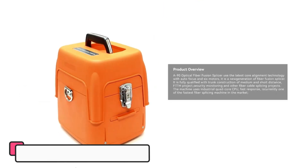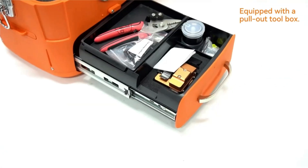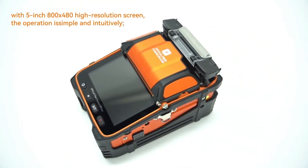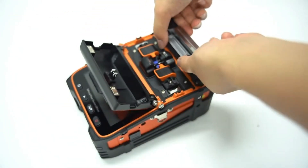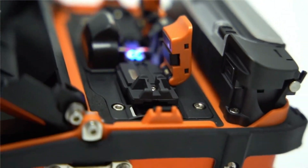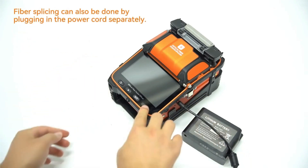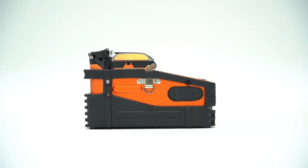Number 1: FCST Communication AI-9. The FCST Communication AI-9 Optical Fiber Fusion Splicer is a versatile tool for fiber optic installation and maintenance professionals. It supports multiple fiber types, offers fast performance with a splicing time of just 5 seconds and a heating time of 15 seconds, and features a 5-inch TFT color display for easy monitoring. The machine has a six-motor autofocus system for accurate splicing, low splice loss, real-time arc calibration, and exceptional return loss. It offers fully automatic splicing options for both novice and experienced technicians.